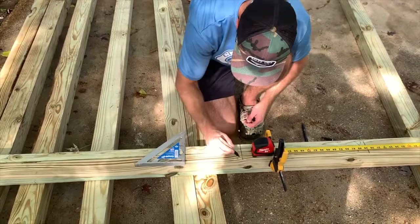Here I am taking the sill plate and nailing it into the cripple stud below. And then what you'll see in a second is I will take my jack studs and I'll attach them to the side wall studs, as you're seeing here. Again, using a bunch of nails to ensure that I have a good secure connection and that these window frames are going to be secure. And then finally, I'm putting in the window header and I'm going to take my nail gun and attach that into the jack studs below, using 2 nails per connection for that.